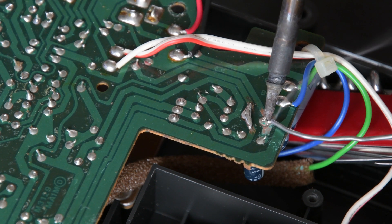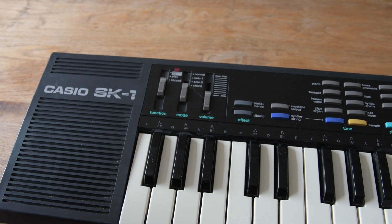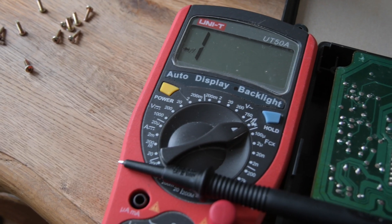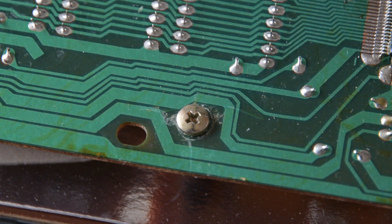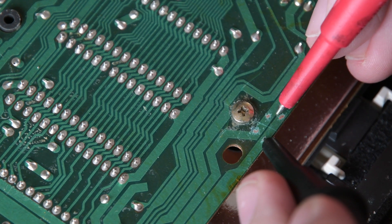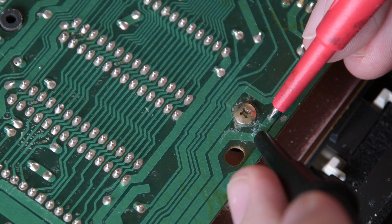It's always good when you find a fault so quickly and it's not too bad, but testing the unit again it's still not getting any signs of life, so I'm going to have to look around the circuit more. I can't see anything burnt or broken, so I started testing tracks going from one side of the circuit to the other and quickly noticed these two tracks were not connected. Looking closely we can see a scratch here — it doesn't look like much, but that scratch is enough to stop the whole unit working.